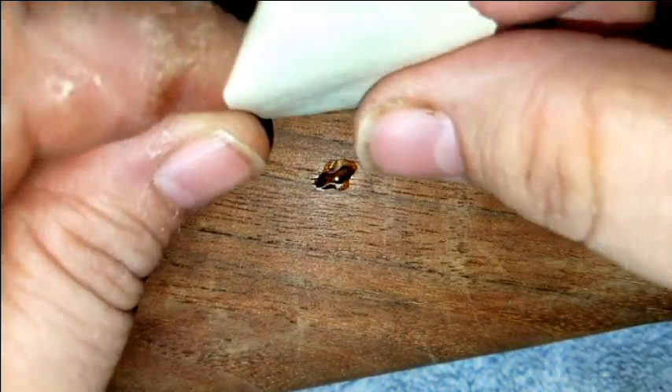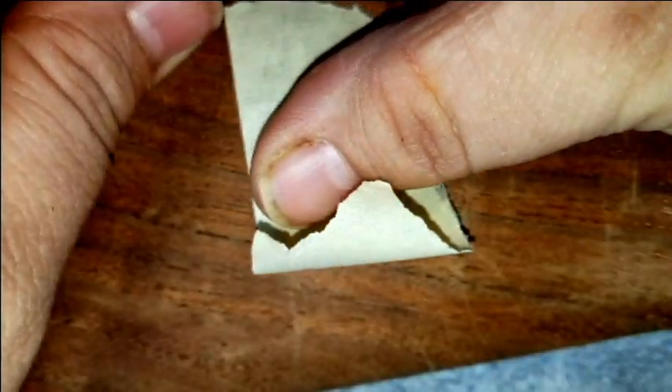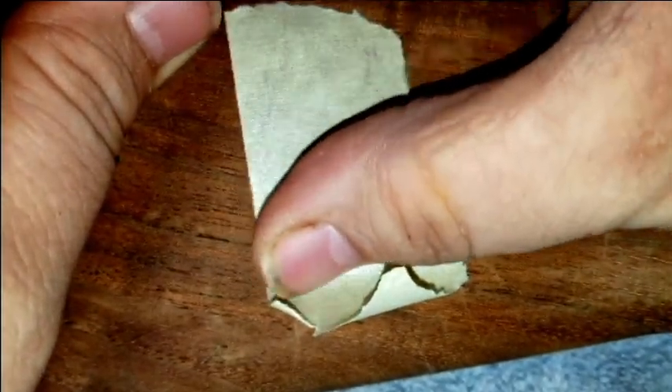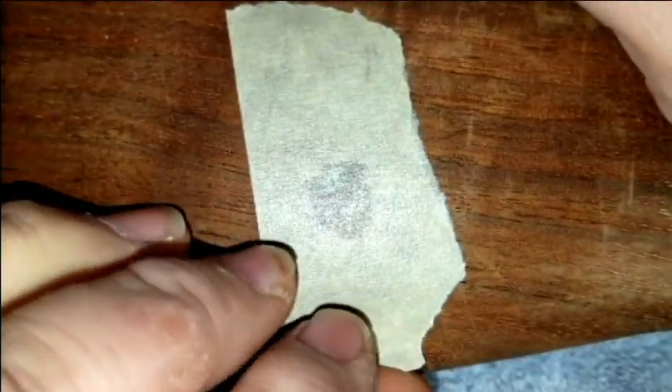You don't have to worry about being neat. You don't want to slather it on, but you want there to be a little bubble on there so that you don't have any air pockets — you want it to be a little bit proud of the surface. Then you're going to take your masking tape, lay it down one side first, and slowly push it down over the surface, spreading it out as you go. After this is all set up, we're going to peel it off and then sand the stock even with the surface. When that's done, you won't even be able to tell that it was there.